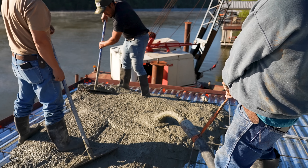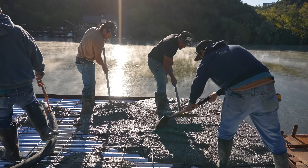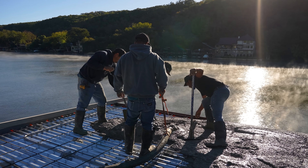Normally in this situation, if we used the pump truck with the boom pump it'd be super easy to get it. But there's not enough space — we can't get the boom pump by the houses down the yard. So we have to use the line pump. But as you can see, we're working it out and the concrete's flowing.